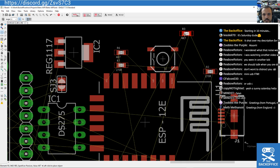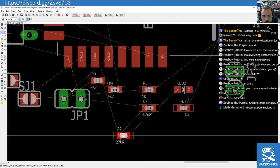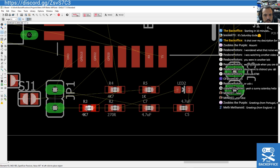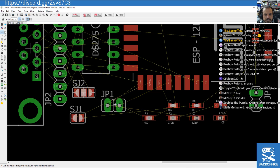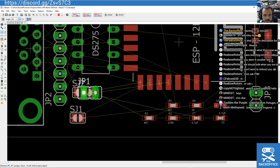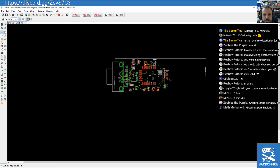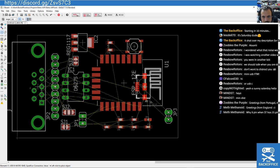We can go there, get our switch in. That's somewhere over here, and that's somewhere over here too. Good. Just going to lay those out. I'm not really paying any particular attention to spacing between these components. You can see they're all quite close, but I think you would find in operation that that jumper would be a bit close to that resistor, so if you can, just give it a bit of room, because it's something that you need to use your fingers on to move in and out. You can put them as close as you want almost to solder jumpers, because solder jumpers don't take up any physical room at all, because they're obviously just printed on the board. Right, starting to get a feel for the size of the gadget. Retro Wi-Fi. I really hope I can get this laid out in a single layer board, because if I can, I can mill this out right now and make it. I'll be using that today.